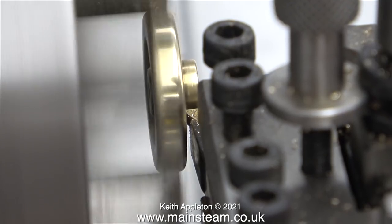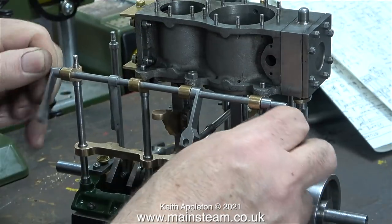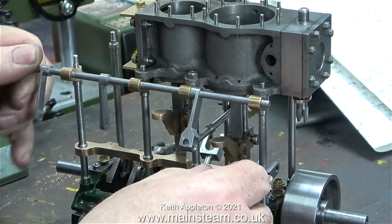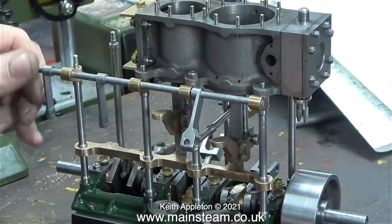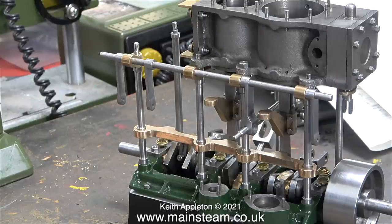Eventually the job is done. I've temporarily fitted the freshly drilled hand wheel in position — I haven't cleaned it up but I don't like it; it's too small and it doesn't look right being made from brass. In fact the entire mechanism for the reversing screw — which isn't cut on the shaft yet — has insufficient clearance between the shaft and the lever. The lever can only slide back and forth, but of course on the shaft it swings. I think that's about it for now.